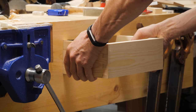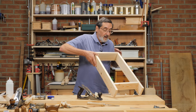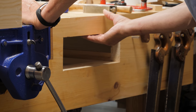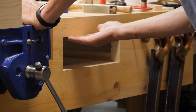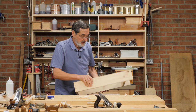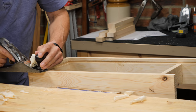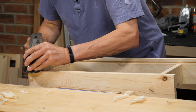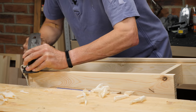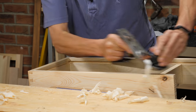Now it's getting tighter, and it's tight at this end, which you kind of expect. This is catching here. Can you see? I've got some damage area here. And that's because there's something inside here, a little bit of glue somewhere on the underside, so I'll have to pare that down. So now I'm down onto the underside here at the front edge that's stopping it from going in. And I just keep taking this down, working with it. Two or three shavings at a time. Until it fits